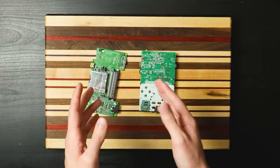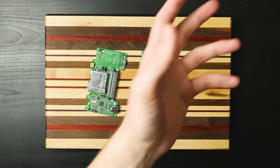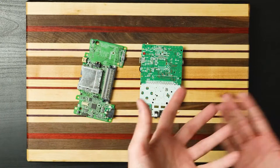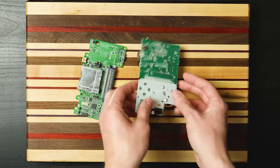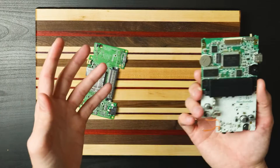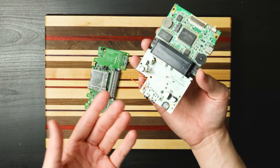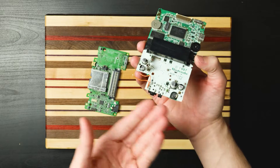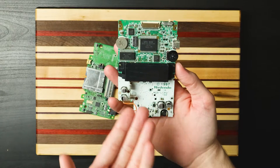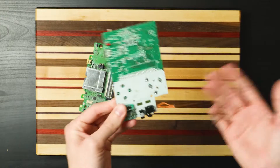For a while I would test them before doing anything, then clean them and retest. Then I started cleaning them and then testing. Then I started cleaning them, replacing obviously bad things like battery connectors if they were corroded or volume wheels if they wouldn't spin — things like that. And then just reflowing all the things that are probably good but might not be functioning well because it's old solder, like the headphone jack or even the power boards. This board is two years older than me — sometimes you just gotta reheat it and it'll be fine.